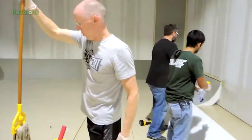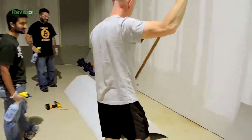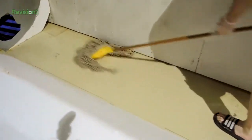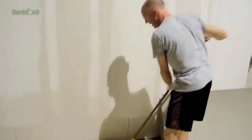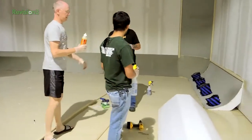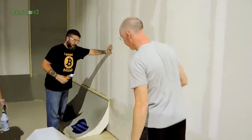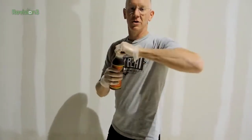The mop is the fastest way to get plenty of water on the floor. We did the floors — we're gonna spread this water around, nice and even, nice and wet. The floor was already clean — we went through and scraped off any old gunk. Next step: lots of glue. David and I are going to team up. We should have made a line on the wall so that we put our glue right up to that line, but we're going to eyeball it.